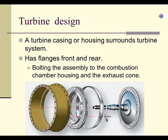When looking at a turbine assembly, it starts with an outer case called the turbine housing. Inside is the stator assembly — the first-stage stator is called the nozzle diaphragm or turbine nozzle. There's often a small spacer ring between the stator and the blades. For open blades, there may also be an abradable ring called a shroud ring or shroud segment. On PT-6s, when you pull the turbine wheel out, you have individual shroud segments you have to number and put back in the right order and orientation.